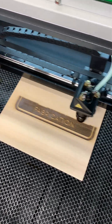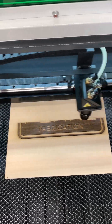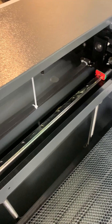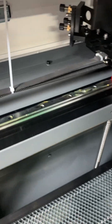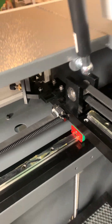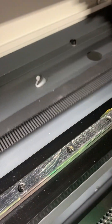Next I want to briefly talk about some important steps to take before operating the laser. I would highly recommend that you read through the user manual found on the Cloudray website before you start operating your own machine. The first thing is the three zip ties you'll find on each belt within the machine — these are put in place to prevent the axes from moving during shipping but they'll need to be cut off before use. You will also notice zip ties on the end of the belts, but these should not be cut off. Be very careful not to cut the belt when removing the zip ties.